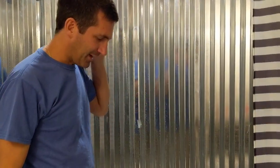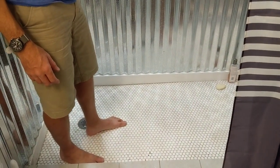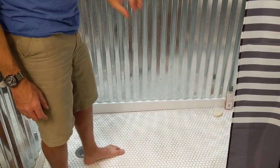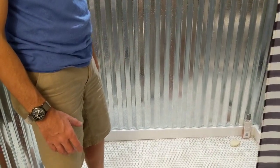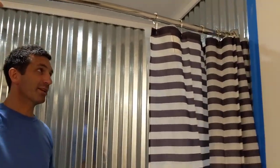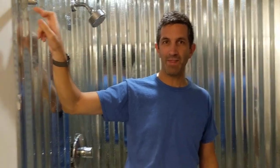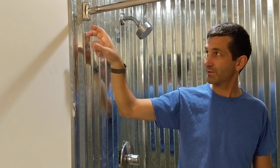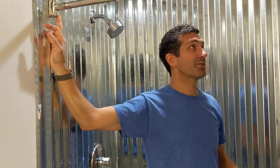So the quick steps: I did the floor first — the entire shower pan and everything. Then I did PVC around here. Then I put the galvanized metal on top of the PVC. Then I put the trim around the top. And lastly, I put in the shower curtain rod. Don't forget — before you get too far you need blocking behind the walls to mount the shower curtain rods. You don't want these to screw into drywall; they've got to screw into 2x4s.